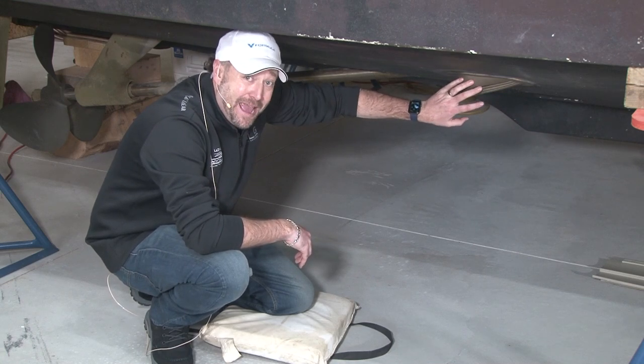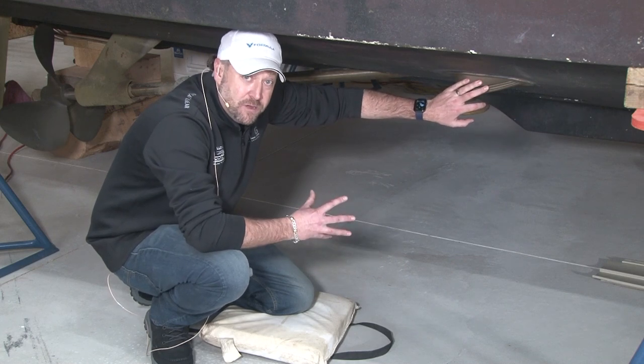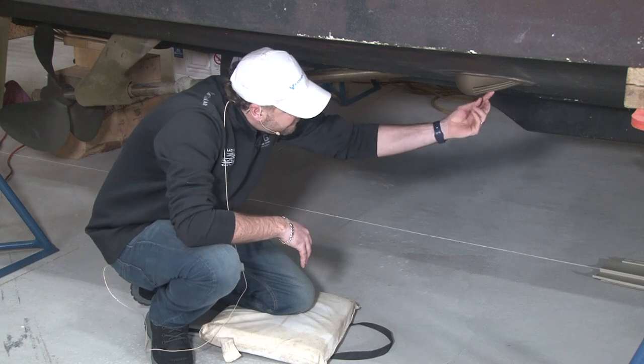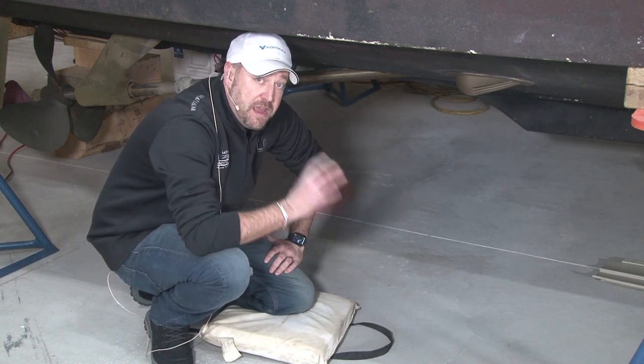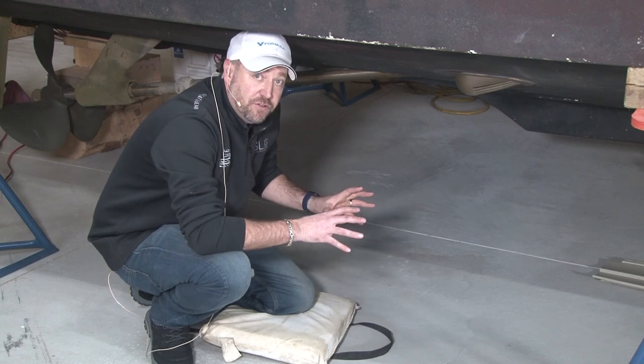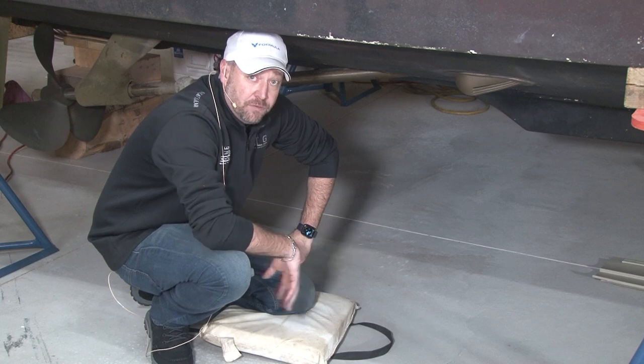I've seen plastic bags get wrapped up in these. I've seen those Mylar balloons. Those are big ones. They'll actually wrap themselves in and through these grates here. So take a look at them. Make sure that they're free of any obstructions, and that'll help the longevity of your boat, because an overheated boat is not a happy boat.